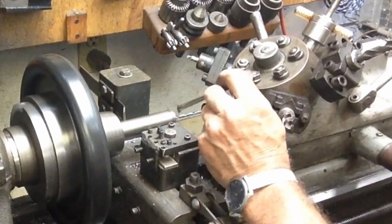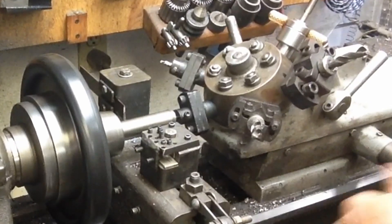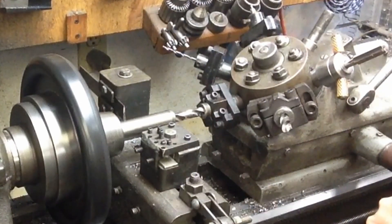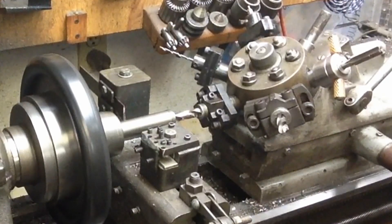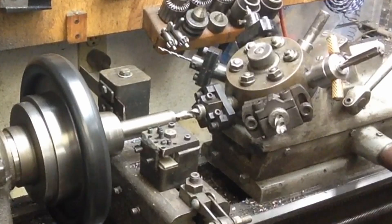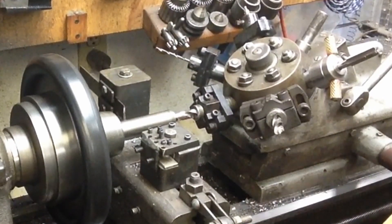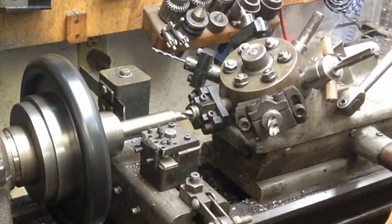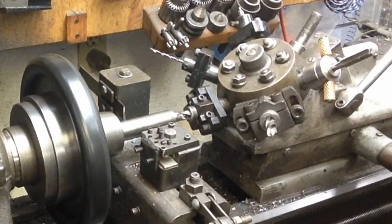Everything pretty much self-aligns once you get the initial center installed in the stock you're machining, so it's not an issue but it could become one. The chuck is a good chuck and I'm really happy with it. I need to have an outboard support for the extra stock hanging out the back. This particular setup is not really an issue because I think I only had about a three foot length of material in here and it aligns itself relatively well. After this I ran some hot rolled carbon steel, and with that being a rough finish and not completely concentric, holding it in the collet isn't ideal.